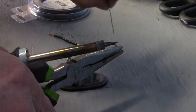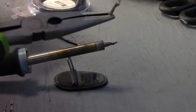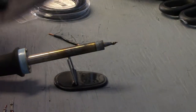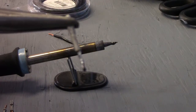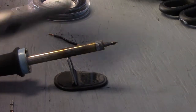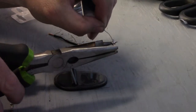So what I'm doing now is I'm basically pre-soldering each one of these. Basically what I'll do is solder both ends, then hold both wires up together and they'll heat up and connect, and then once I lower them down just a little bit they will re-solder together, and then I just heat shrink them. I do have to remember there's one of these that's smaller.